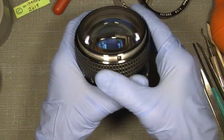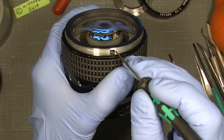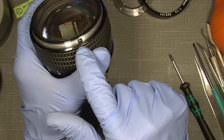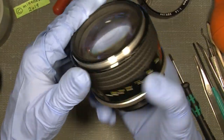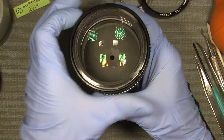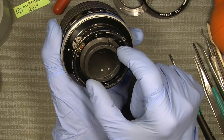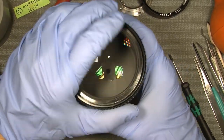It will never move. And this is not a screw. It's actually an adjustment, eccentric kind of. So no unscrewing or movement of this. There's no need for it. Now, set the lens to infinity before you take it out. That's important, because then the back helicoid will also sit in the correct position,